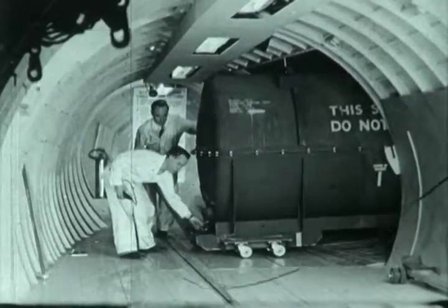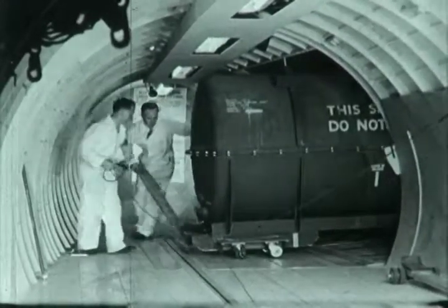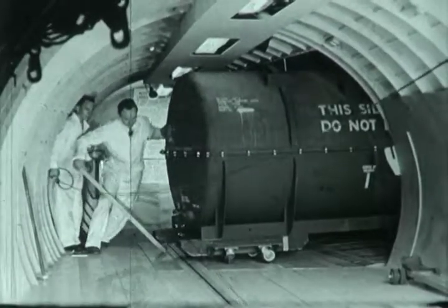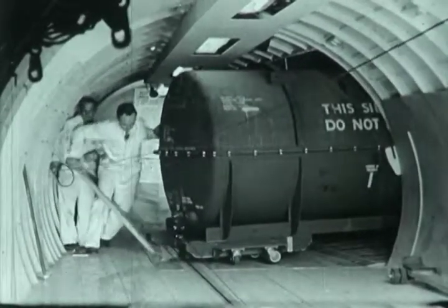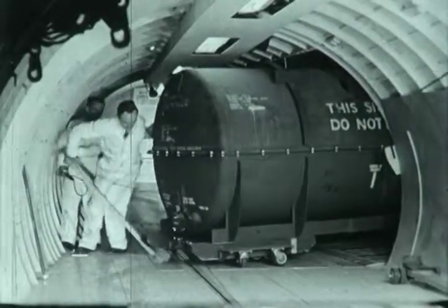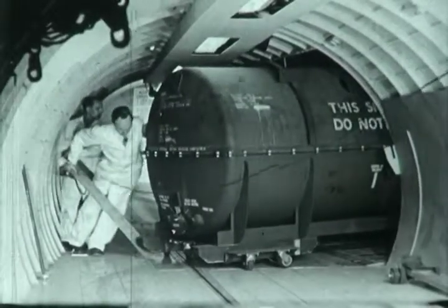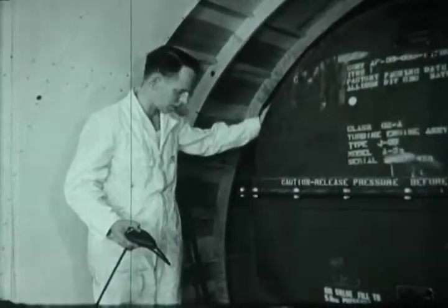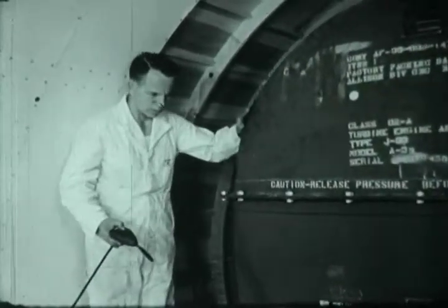After removal of the cable from the snatch block, straightaway pull from the floor conveyor swings the wheels of the dollies around to bring the container into alignment with the cabin. Here again, the only manual effort required is for steering. The conveyor continues to pull the cargo until the desired tie-down position is reached.